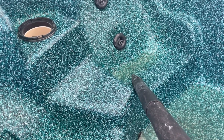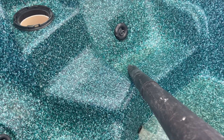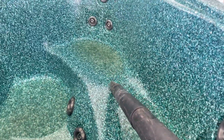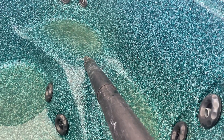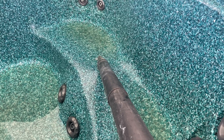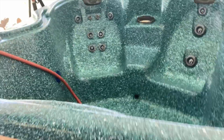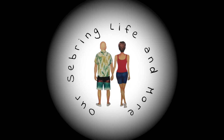A trick I learned while vacuuming here is to not submerge the head completely in water, but just take a little bit at a time. That way the hose doesn't get too filled up and the shop vac can handle the weight better. If I just take a little bit at a time it continuously keeps drawing it up and it's a lot faster with a lot less effort. All the dirty water's been taken out - put the hose back in and let's fill her up.